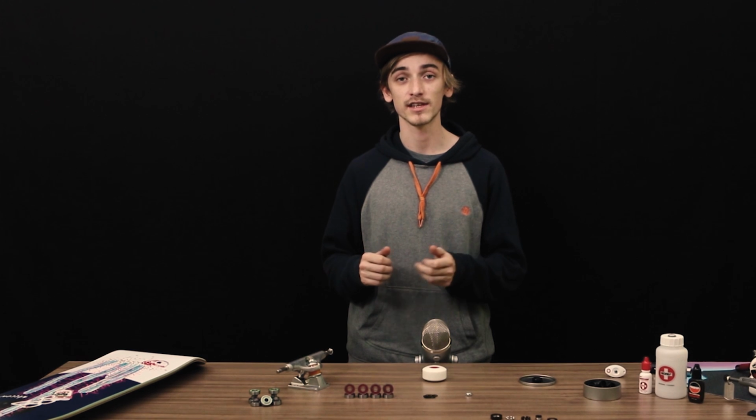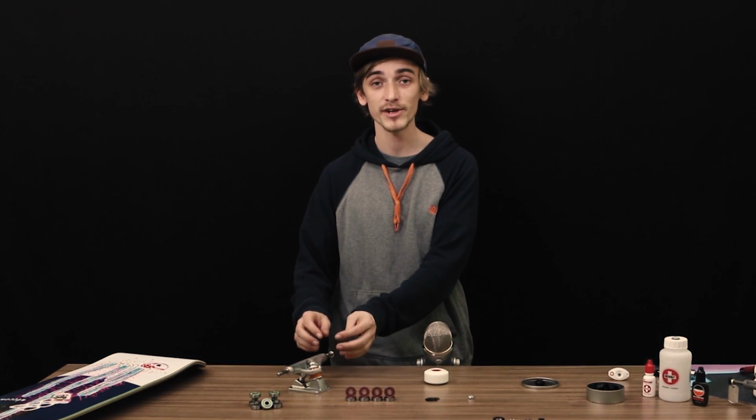Let's now talk about the ABEC rating and why I don't recommend using it for choosing bearings. First thing is that the ABEC rating was initially created to suit industrial bearings that are turning way faster than skateboard wheels. So that's one thing. The second is that while skateboarding, you apply forces in a very different way than industrial bearings. So, in general, the ABEC rating will not really give you a clear indication of quality, and you will notice the very specialist brands of bearings don't even mention it anymore.